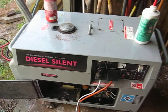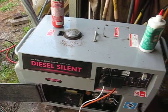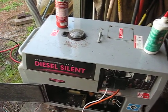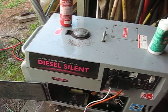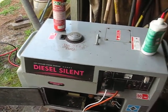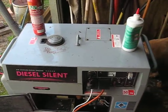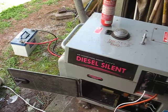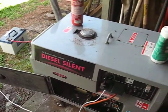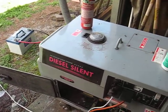What I've done is had an electrician out and he put a plug into our power box with a circuit breaker — I've had it professionally done. Just through throwing a sequence of switches, I can feed the whole house if I have to. Our experience is that yes, we do have to do a bit of load shedding. High demand devices like toasters, electric jugs, electric fry pans, even microwaves consume a lot of power. So whenever you're using a generator, do a few test runs — it will help you decide what you might have to load shed in the house so you don't stall your generator or overload it.